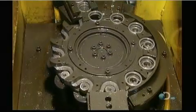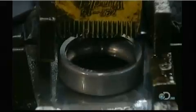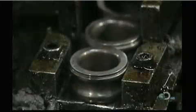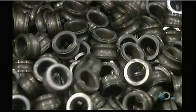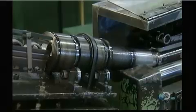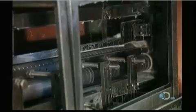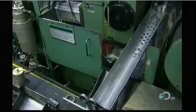They first prepare to shape the rings to the right thickness. They insert the inner ring into the outer ring, and the set passes through a grinder that alters the width to the correct thickness. A gauge checks the width of each ring as it exits. Now they separate the inner and outer rings in order to grind their outer circumference on separate machines. The outer ring enters the grinder, which shapes its outer surface to a precise roundness and diameter. A water-based liquid keeps the ring from overheating, which would cause warping. The ring exits the grinder through a gauge that checks the diameter.